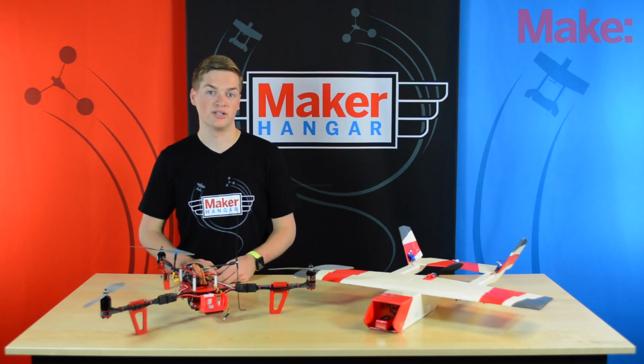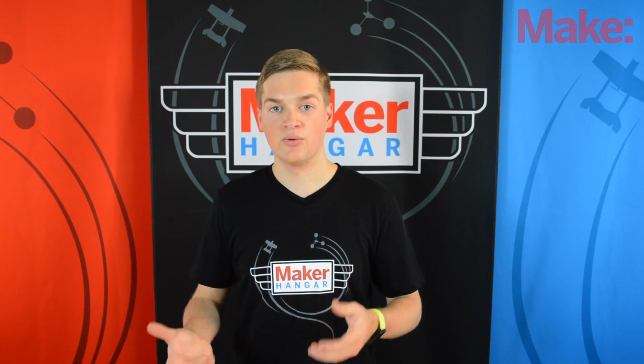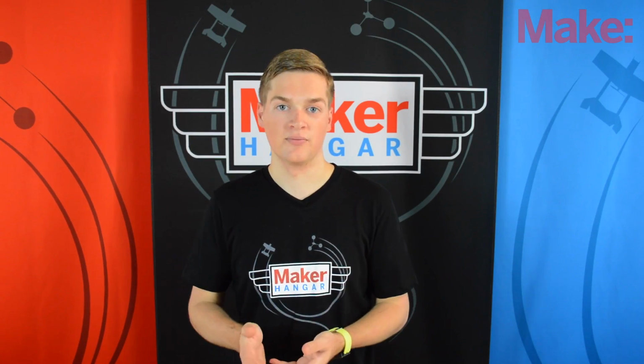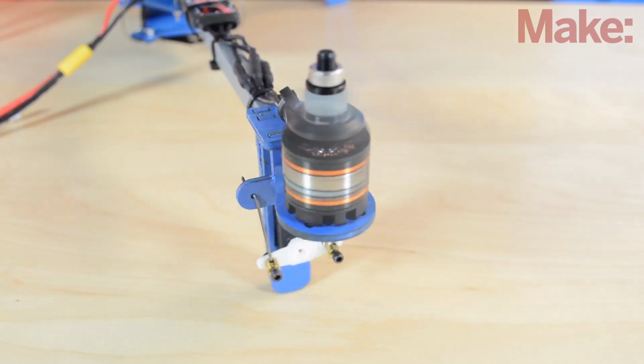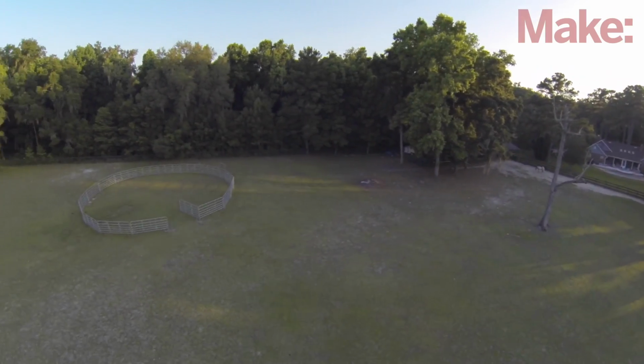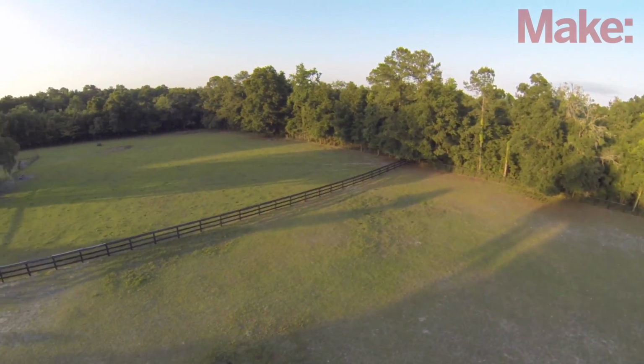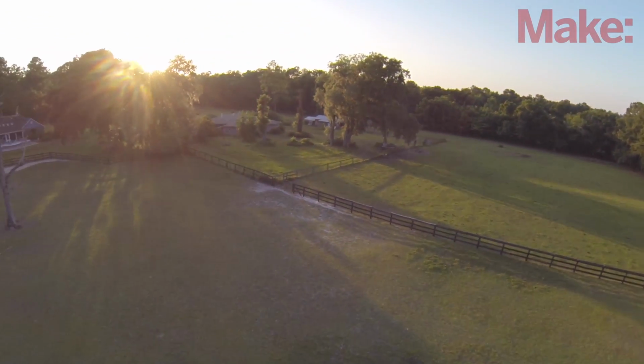for some video projects. With the tricopter, the motor in the back can tilt, which does the exact same thing as the quadcopter did, only in a mechanical way. This means when you let go of the stick, the motor takes time to get back to where it was when it was hovering. This gives a slow stop every single time and gives you a little bit of overshoot, which makes it look more natural and kind of like if a human was moving the camera. And also because the motor in the back can tilt, you can get much higher yaw speeds than if you were just trying to slow down some motors to get torque roll.